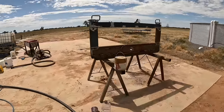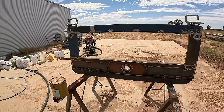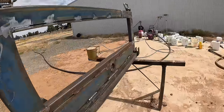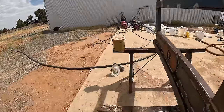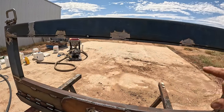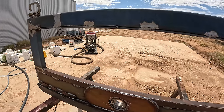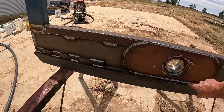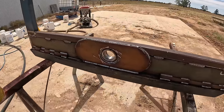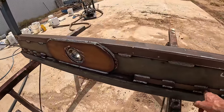I'm here — if you've been watching along, we made up an adapter to fit the John Deere corn front onto the Case header, so this is it in its flawless glory. It's actually upside down — we had a bit of a 10mm step between the front and the feeder house, so we've just welded a bit of 10mm flat bar in there, and then I cut that plate out just to reinforce around the bush where it swings.